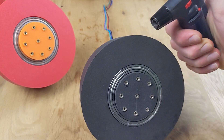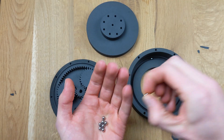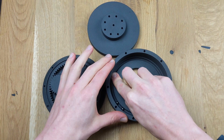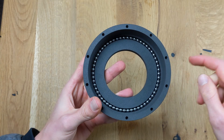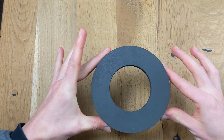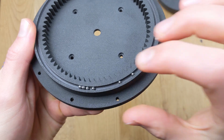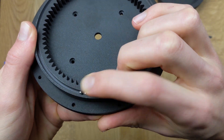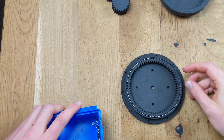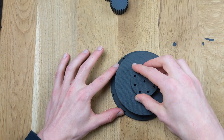Before we set the gears on fire, here's a quick montage demonstrating how the gears are assembled. First, I press the steel balls into the ball bearings. They stay in place even if you shake the gear part slightly. Additional steel balls are integrated into the ring gear, which constitutes the first stage. This design allows the second stage to rotate over the first stage with less friction.